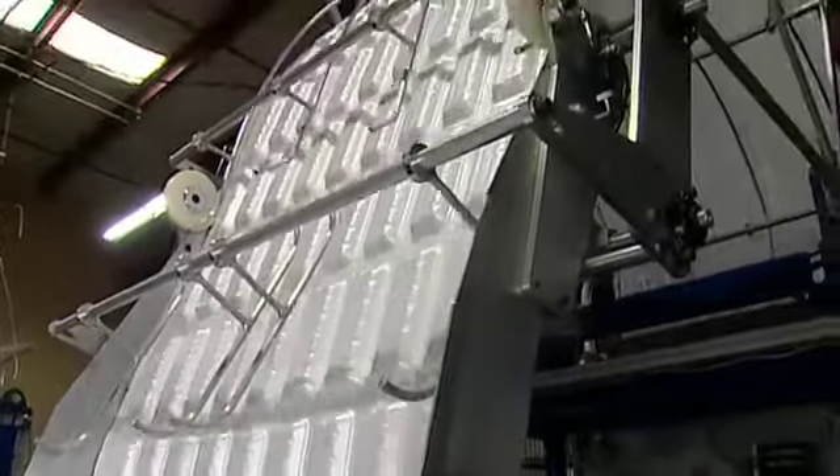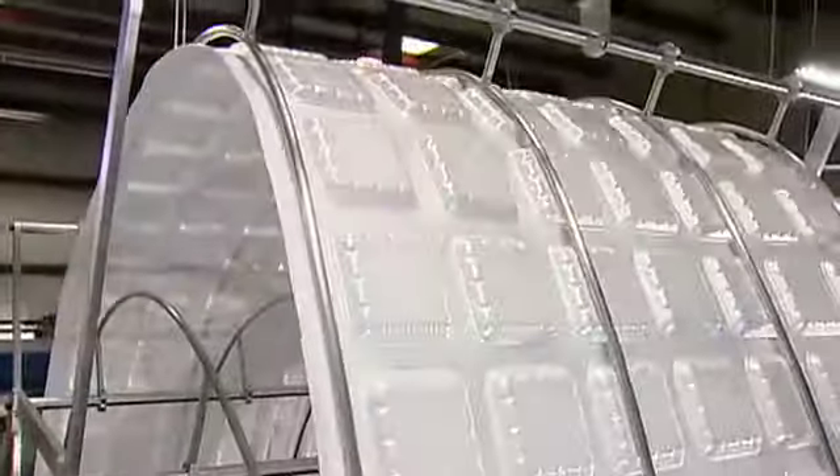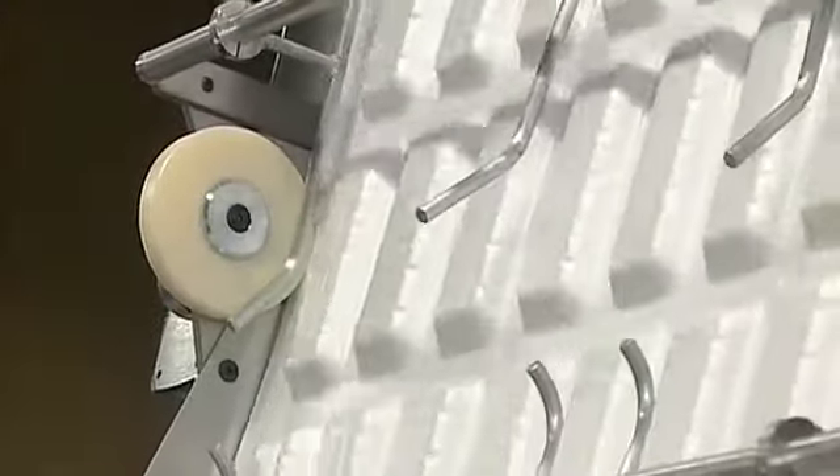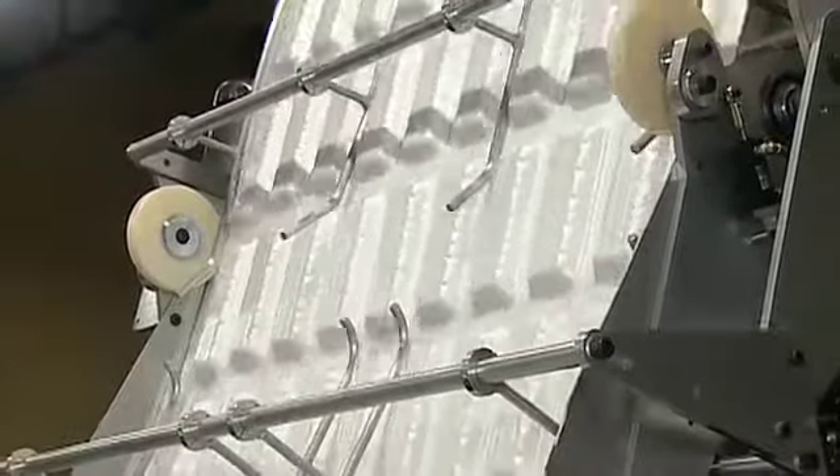The SX44 Thermoformer is designed to go fast, so we needed to get the foam into the trim press with a relaxed web. What we're doing is using a power canopy. Whenever the sheet feeds into the trim press, the canopy pulls more sheet up ready to go — it feeds in, it restocks, continuously. The power canopy always gives you a relaxed web to feed down into the trim press. The treadle wheels are always feeling the same amount of resistance for consistent feeding and consistent cutting all the time.